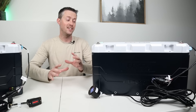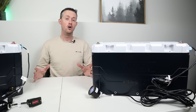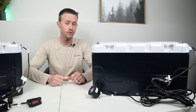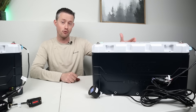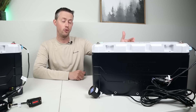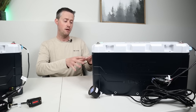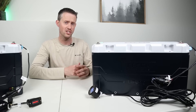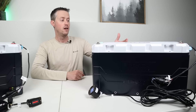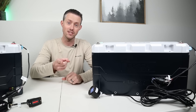I'm really interested to see how this battery differs on the inside versus the version one, so at the end of the video we'll tear down both batteries and compare them side by side. But before the teardown, I want to do all the performance testing: first a capacity test to see if we get the full 460 amp hours, then test the heaters and built-in low temperature charging protection, and finally a max load test to see if we can pull the maximum continuous rated output without the battery shutting down.